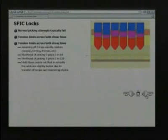However, as there's always a however, you notice I'm showing these little holes drilled through the bottom here. That's because, in fact, the plug and the control sleeve have holes drilled straight through them. They don't involve the functionality of the lock when it operates, but if you eject the whole core, you can seat it into this little clamp, and you can stick a punch tool down to eject the pins if you want to repin your system. The punch tool sticks through these little holes.